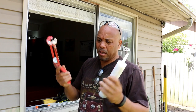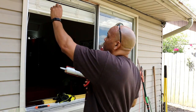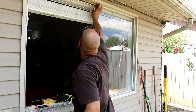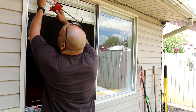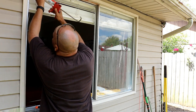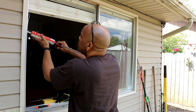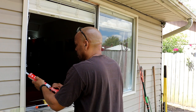We have our silicone for the plastic sheet. If you don't have a caulk gun or time to buy one, you can buy the kind that comes in a little container that you squeeze with your hands — you don't really need a lot up there. Put just a small bit of silicone right on the ledge, and that's what we're going to press against to hold it in. We have the area nice and clean; don't put too much or it'll fall off — just a little, take your time and gently apply it.